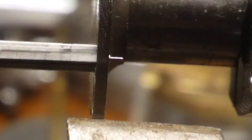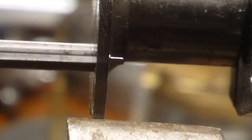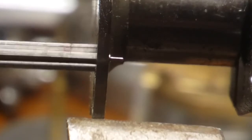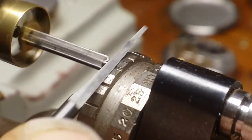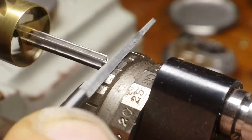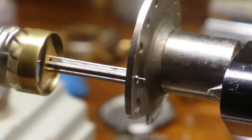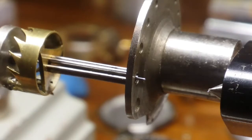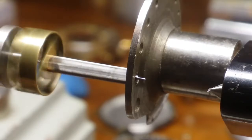When I support the pinion you can actually see that it's the pivot that wobbles. So what I'm going to do is cut down the pivot just slightly, just enough to make the pivot run true. Here I'm finishing the pivot. This was an issue I had left previously because it was done by the manufacturer and I thought it had obviously run well with that slight wobble — I'll leave it. But while I was fixing things, I thought I would make it true and eliminate all possibilities.